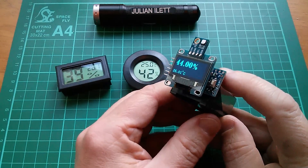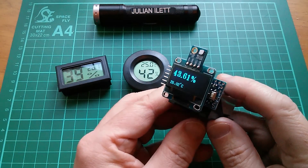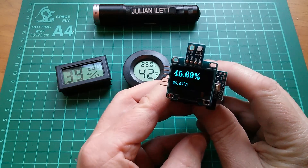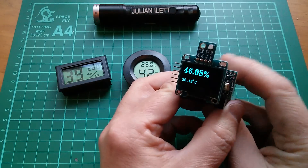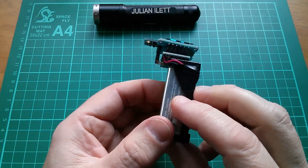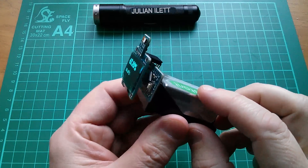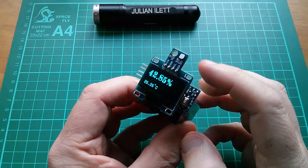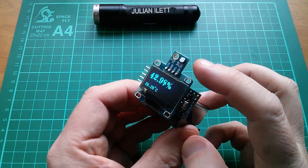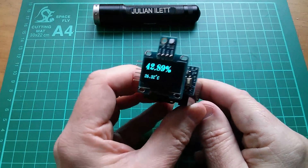So that's perhaps the next thing to address with this project — maybe slowing the CPU frequency down, though that'll mean re-burning the fuses, which is a bit more complicated. But for the moment I'm happy. I'm just going to blow on that sensor to see if the humidity value goes up — and yeah, 45 climbing up to 46 percent. So it works. My new miniaturized Arduino Pro Mini-based hygrometer with the three electronics boards all sandwiched together, and still with a plug and socket so you can take the display and sensor off. I might make more display and sensor combinations with the SHT30 and BME280 to try different sensors out. But for the moment, that's the miniaturized Arduino hygrometer.